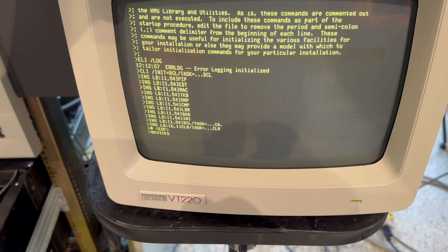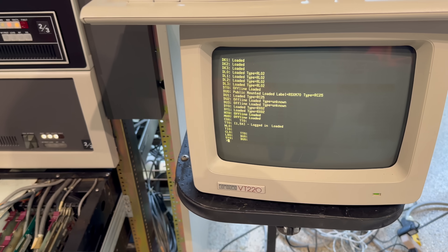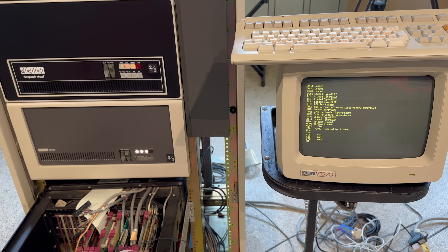With the ethernet port remoted, I can now connect to the Unibone and do things like load the boot loader for the PDP-11 into memory, but I still need to connect to the serial console to actually start the machine — or head to the front panel and start entering addresses and pushing initialization buttons. So to avoid walking or running a long USB or serial cable, I'm going to remote the serial port next, and then we'll move on to battery power.